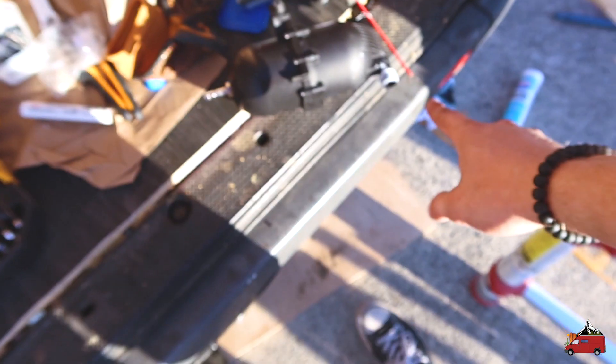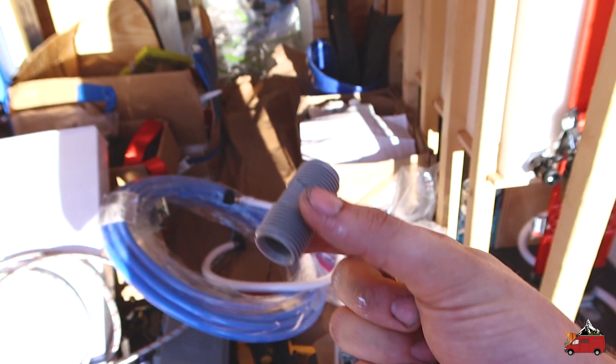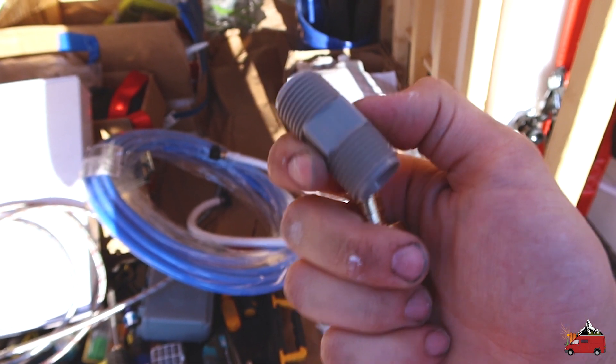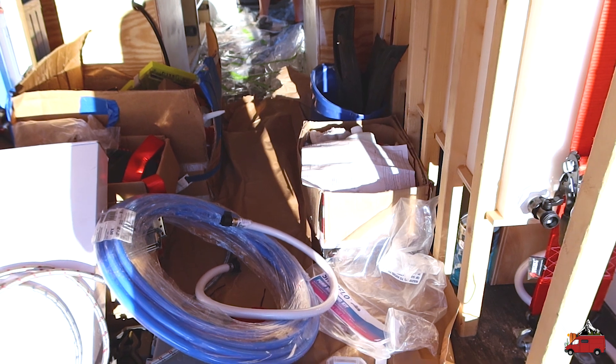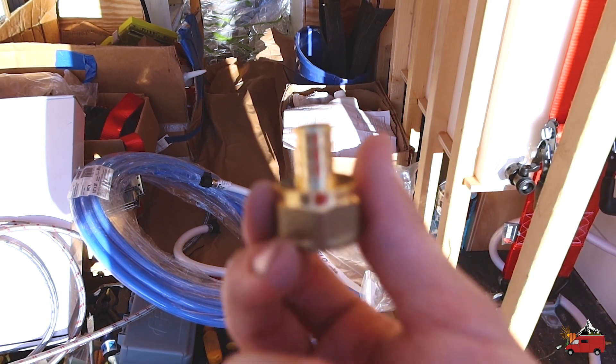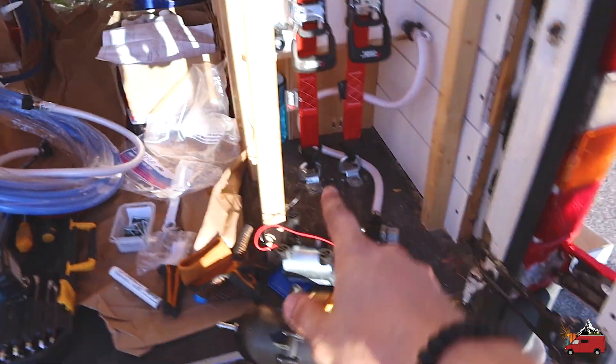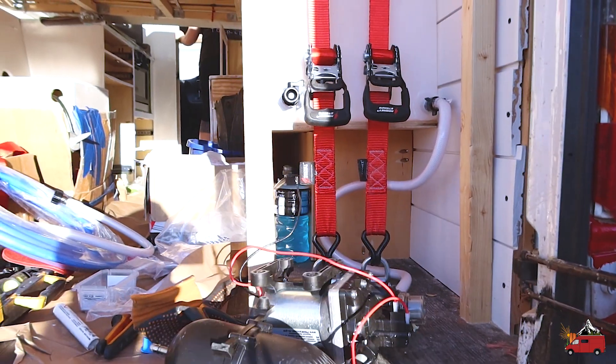From the accumulator we've got one more of these silencing hoses, and then we'll use one more of the half inch male to male fittings that they included. From there we'll probably convert to PEX — this is a half inch female to PEX adapter — and then we'll start running a PEX line down this little pathway to our sink.